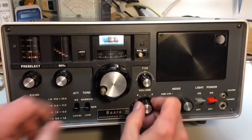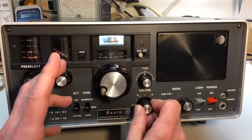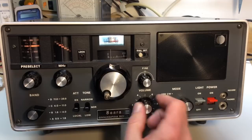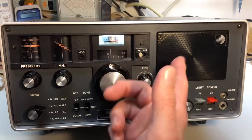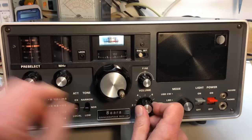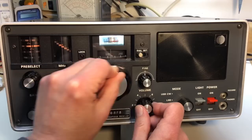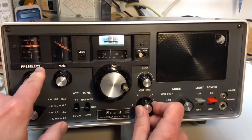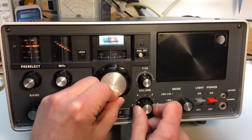You need to play with several controls as you're tuning across the bands to make things work as they're supposed to. If that's not for you, this isn't the radio for you — but if you like hands-on, this is it. And it's kind of fun. There's a lot to hear on shortwave radio other than the ham bands. If you're into ham radio and have never checked out the shortwave bands in between, there's a lot of stuff out there — you never know what you're going to hear. I'm just above 6 MHz here now, about 6.1, and notice I keep tweaking the preselector as I go.